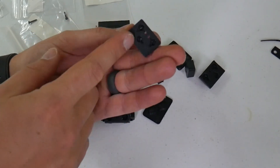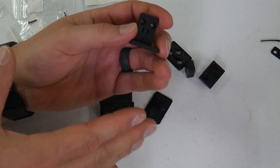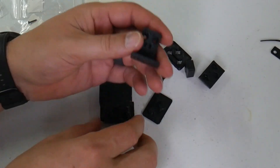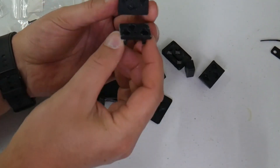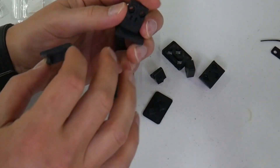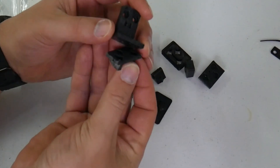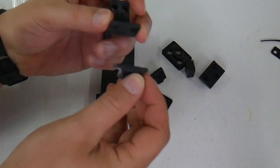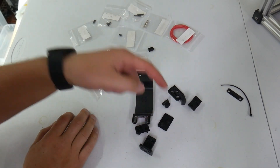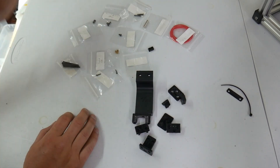This is what we're going to have some magnets in, and our wire is going to run up from here. What's cool that I didn't really understand is that it's using the magnets as basically the leads to have an electric connection to the probe, so these magnets line up, and while these ones here have the two ends of the probe, these ones here have two wires come through and go underneath them — and that connection is what enables the electrical connection between the two. I actually need to file that down a little bit to get it nice and flush so the magnets can get a good connection. These are just some other support pieces to get everything mounted properly, and I have an extra carriage just in case.